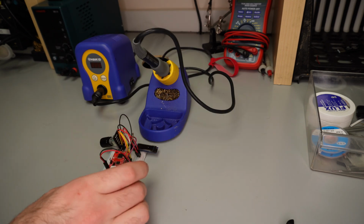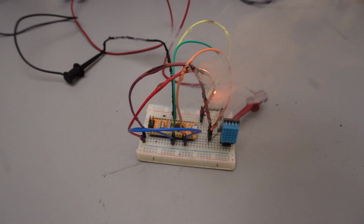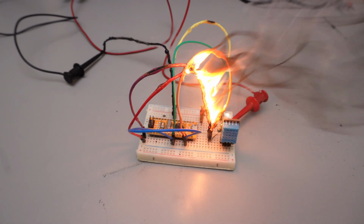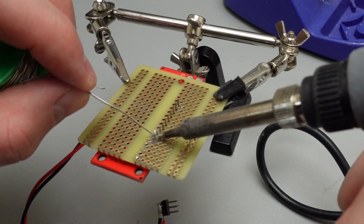For now, we gotta deal with this janky breadboard. There's no way we're keeping the electrical this way. I don't want wires coming undone causing short circuits or fires, because that would be the exact opposite of what a cooling pad should do. So we'll solder robust connections on a perforated board, then we'll finally have everything we need for a crisp build montage.